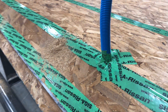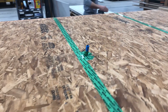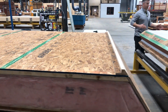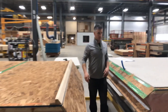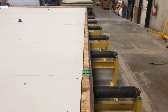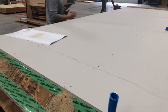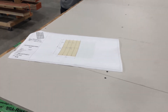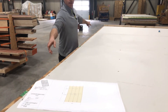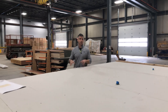You can see we've taped this whole panel. We've routed some conduit for some specialty surface-mounted fixtures in this building. This is a Benson Wood build, so typically we see all of our surface-mounted wiring having to go up these seams on either side of the panel. We leave the finish an inch and a half back — one, for a strip of tape to air seal the building on site, and two, for a place to run Romex from the eave to the ridge or to have a surface-mounted box. Our batten strips carry through from finish to finish on the panel all the way from the eave to the ridge. The Romex runs in there, it covers it up, and then we use light blocks or fan blocks for any surface-mounted fixtures.